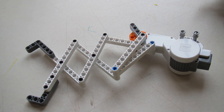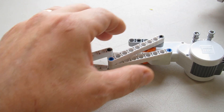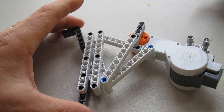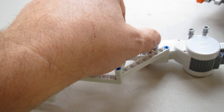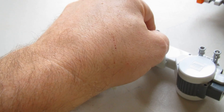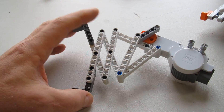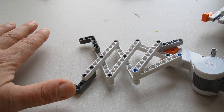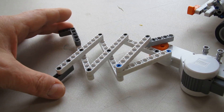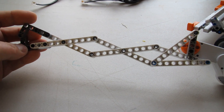Now I'm going to give you an overview and a quick build on an extending pincher arm. The servo only really needs to go one quarter of a turn to fully retract and fully extend the arm, so it's a very fast action. It's also made so that this can just keep cranking around and around. If you're remote controlling it, it makes it easy — you just hit the space bar and it does its deal. You could add as many of these as you can, but you'll find it gets droopy and puts a lot of load on the mount point the further away it gets. This seems to be a pretty practical distance, and if you just want to annoy somebody and run up and pinch them, that works pretty good too.